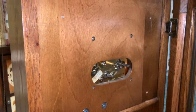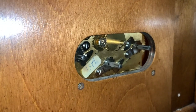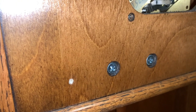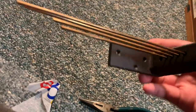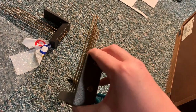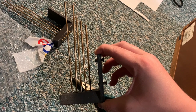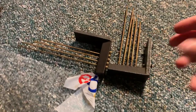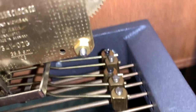I've got the face and hands off the Sandringham. Now I just need to unscrew these two screws, because those are what's holding in the chime rods. Once I do that, I can get the new chime rods put in. I'm going to get these screws unscrewed and get back to you. Alright, I just got the old chime rods out — as you can see, that one is just broke out. I'm going to go ahead and use either the current screws in the clock or the ones that came with the new set, and install the new rods.